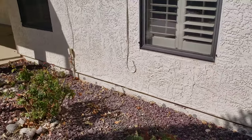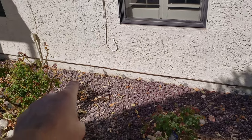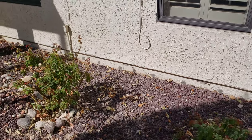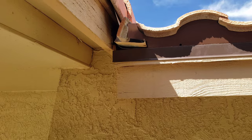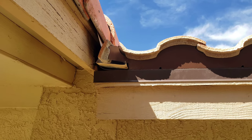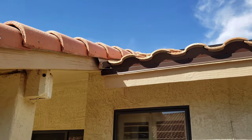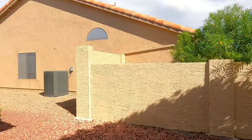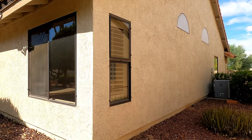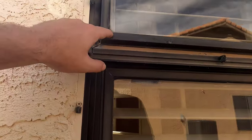This house was not built in the 70s so we're not worried about lead-based paint, but we are worried about the foundation getting more moisture in it. All those little concrete patches are from termite treatment. I don't like the concrete tile sitting in that flashing - we don't want anything building up debris in the flashing and decreasing the roof's drainage function. The east side of the house doesn't look too bad, but again there are some definite issues with the windows on this property.